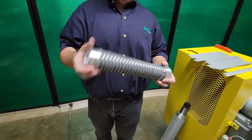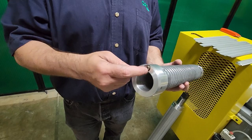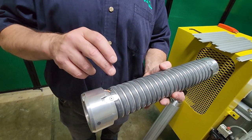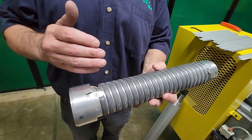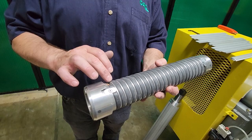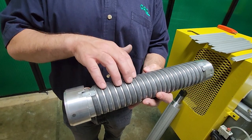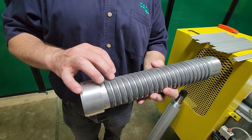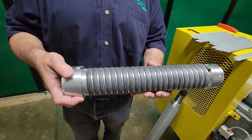This is the internal construction of the air shaft whether it's six inch or three inch. The air travels through this valve, through this copper extension, and into this hollow rubber tubing. The body of the air shaft can be manufactured — this one's aluminum and that's standard — but the body can be manufactured of steel or stainless steel if necessary. There's a geometric shape that's machined into the body of the metal part, and we have this rubber tubing that is engineered to mate up with that shape, and that's spirally wrapped around the inside of the air shaft.